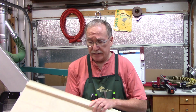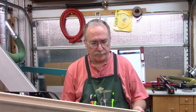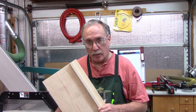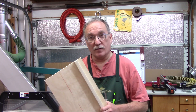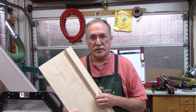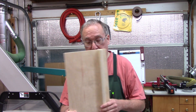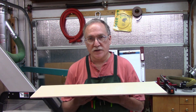To start building the jig, the first thing I did was take a piece of quarter-inch Baltic birch ply, roughly 29 and a half inches long or so. I milled a runner that's sized to fit in the T-slot of my sliding table. You don't want this to be overly snug because you need to be able to get it out, but you don't want it to be overly loose because it'll wiggle around. This is going to be a spacer that I'm going to put between the forward and trailing edges of the Fritz and Franz jig.